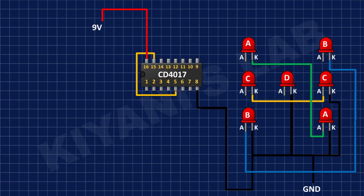After that, I'm going to connect the CD4017 IC and connect its pin number 8 to ground, its pin number 16 to positive supply, and its pin number 5 to its pin number 15.